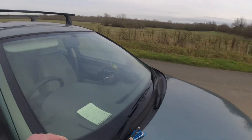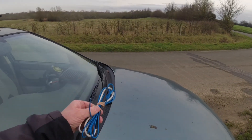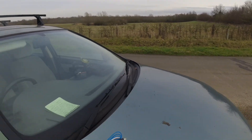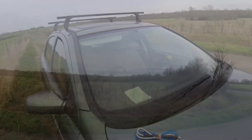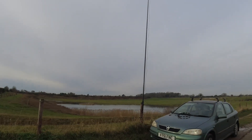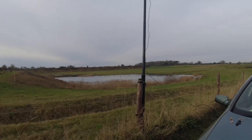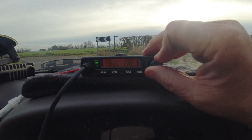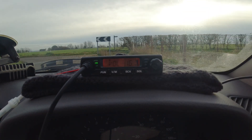I'm going to try four meters now and see what happens. The four meter aerial is up — it's just an end-fed half wave I bought from eBay about 15 years ago. I think it's made with 75 ohm TV coax. The four meter aerial is up, a bit higher than I had the two meter one. Two Echo Zero Whiskey Mike Golf portable. Good afternoon — we better change frequency. Four two five.